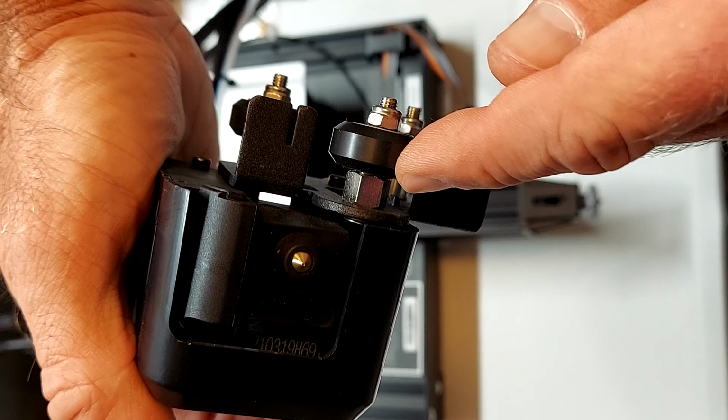With this nut, you can adjust the tension of the wheels on the extrusion. Each one of the axes has one or more of these nuts. The X carriage has one eccentric nut. The Z carriages, we have 2 Z carriages, and each one of those has one eccentric nut. And the Y carriage has 2 eccentric nuts. So in total, you need to adjust 5 eccentric nuts. We are first going to adjust the X carriage eccentric nut.